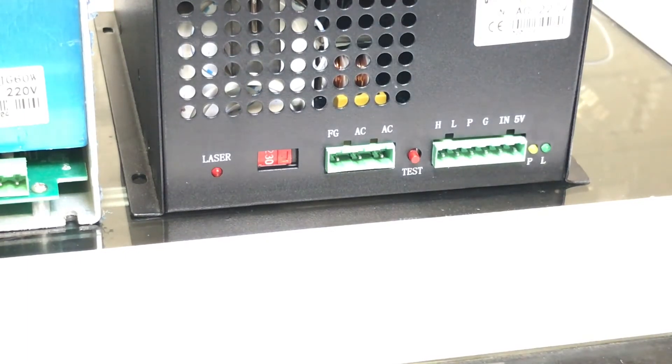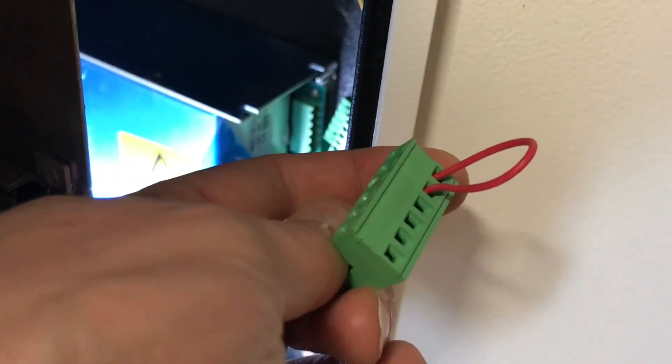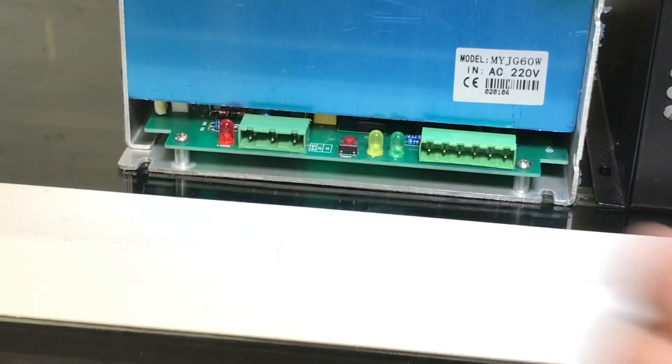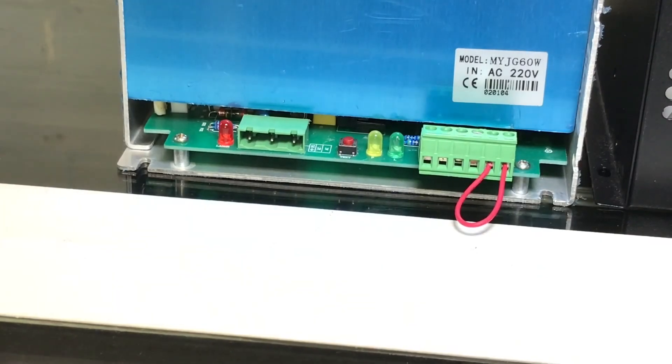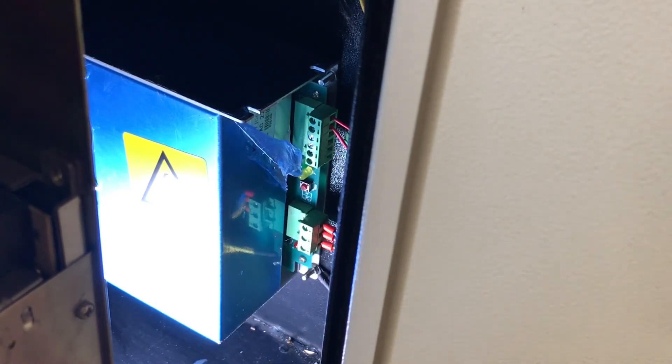You may have been supplied with a jumper connector that looks a little like this one. The connector can be fitted to the signal point of your power supply. Turn off your laser cutter and disconnect the signal cable from the cutter by pulling it out — it may be glued in place. Push the jumper connector into place and switch the machine on again. Pushing the test button will allow you to test the power supply and laser tube without connection to the controller board. This may help you diagnose any problems with your interlocks.